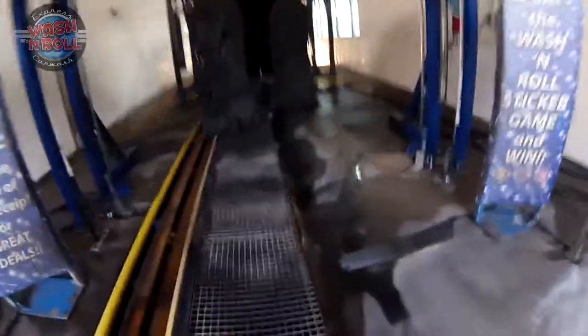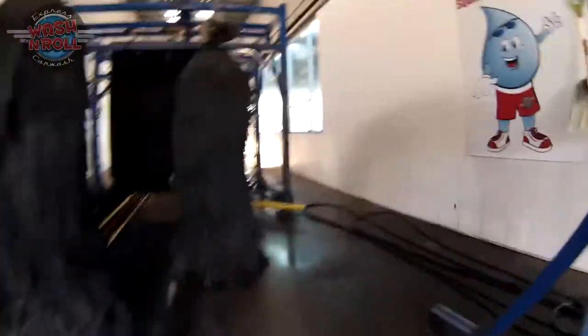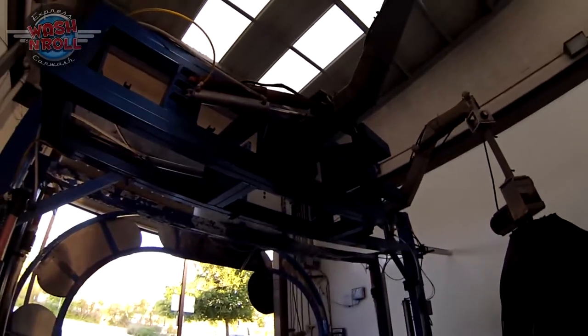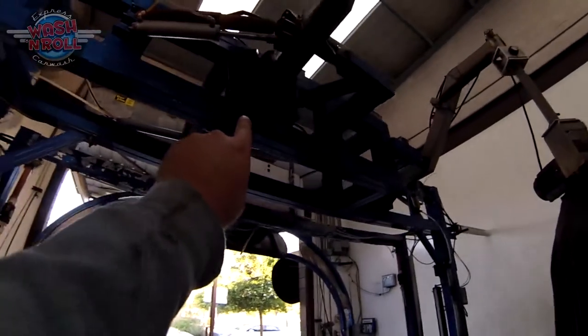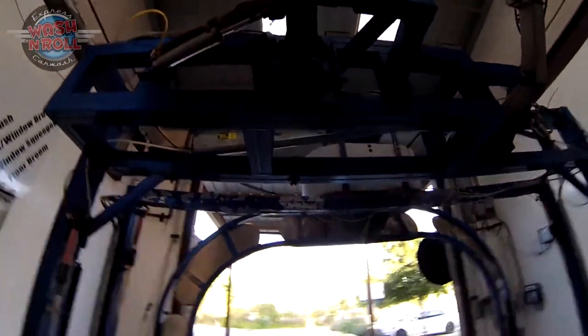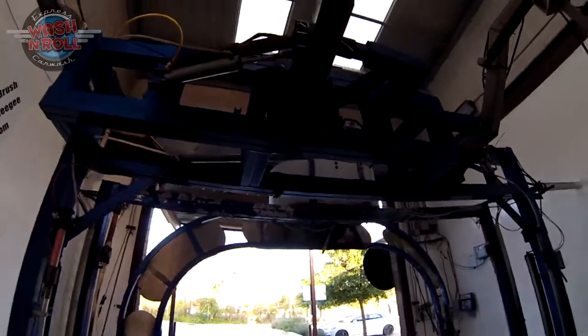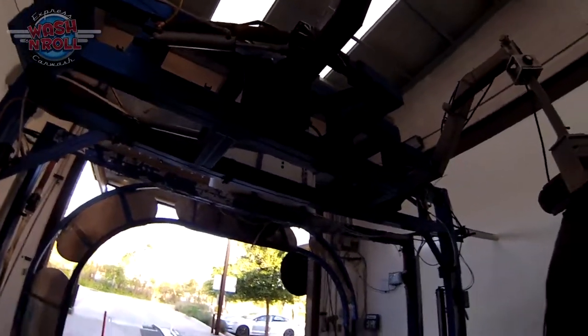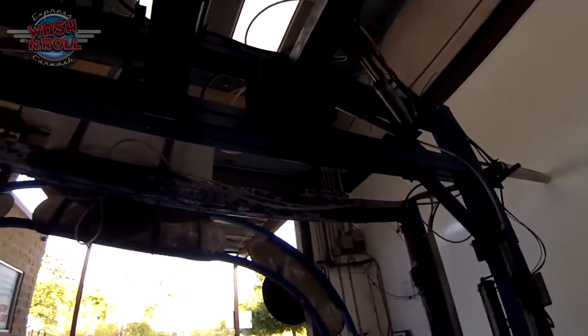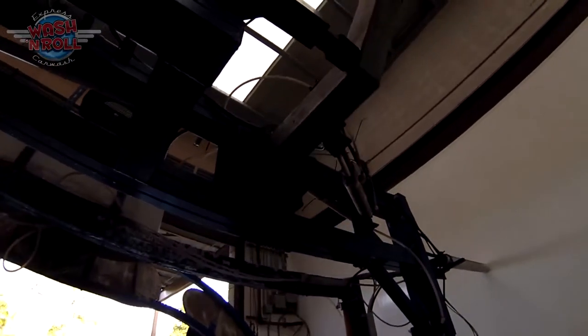As you walk into the tunnel, you'll see that every wrap has four grease zerts on it — two bearings, four greasers. It has a greaser right here and a greaser right here, and also one on the top with two greasers on either side. Because these don't move 360 degrees, it needs to be greased on either side so the grease can make it all the way around the bearing evenly.